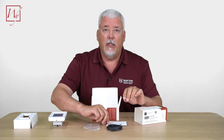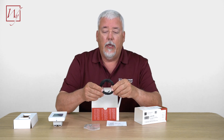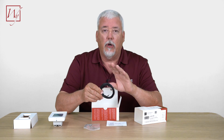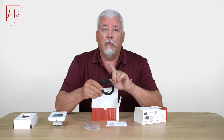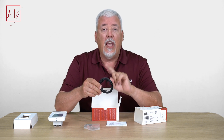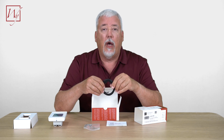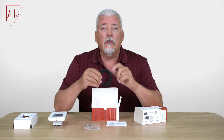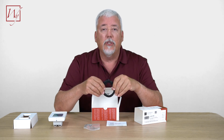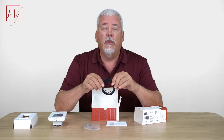Now that we've seen the contents in the box, let's talk about the sensor again. The sensor is located in the back — don't forget to give that to your installer. But keep in mind your floor heating product may also contain a sensor attached to it, so that will give you two sensors: the sensor inside the box and the sensor attached to the heating product itself. Install both of them in the floor, and then only one gets wired to the thermostat. The other one stays coiled up in the back of the thermostat box.